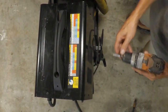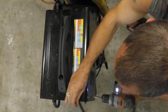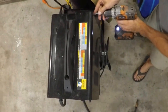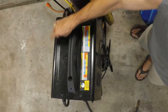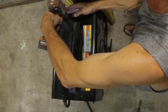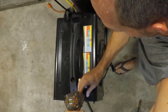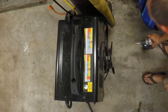We're going to go ahead and start with the install. The case has 13 screws in it that we need to take out - on this side and on the top. You don't want to take the screws out of the hinges because the hinge is going to come off with the case. One more here. The case should be free to come off.